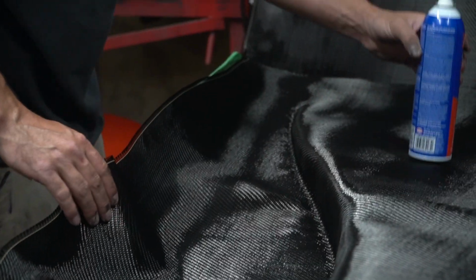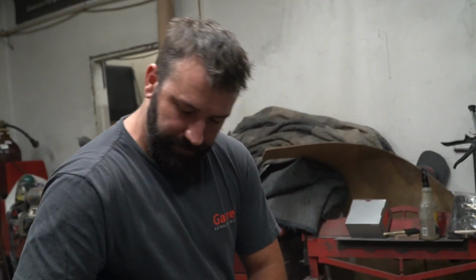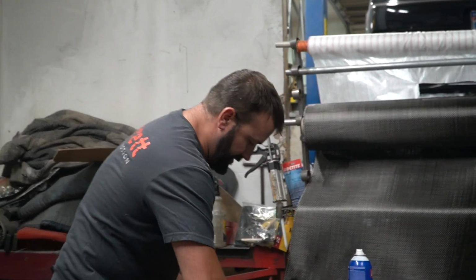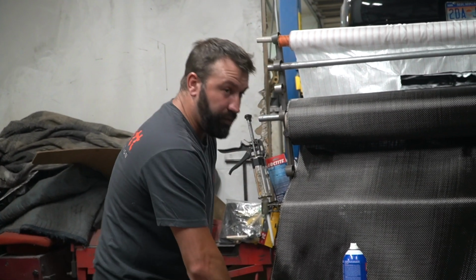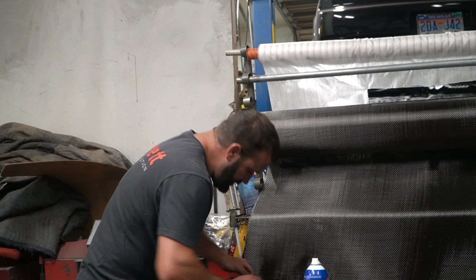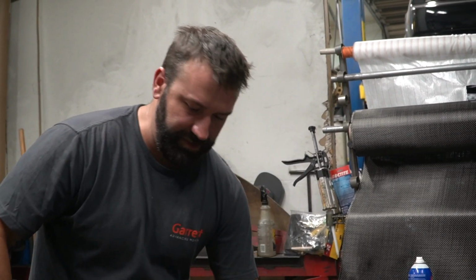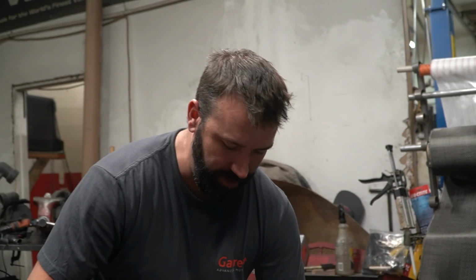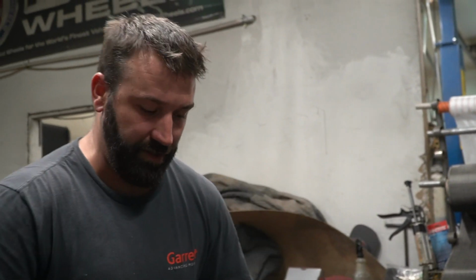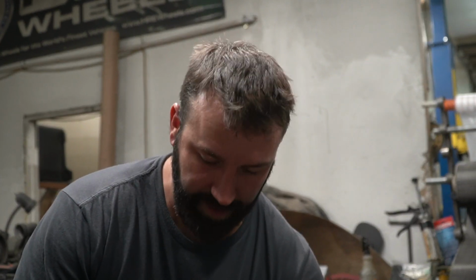And then that's kind of like a whole different kind of infusion process, isn't it? It's already infused. So pre-preg, you don't infuse. Theoretically, you can make your own pre-preg. Basically, it's just a high temp resin or epoxy that you have to get up to temperature. I think the lowest temperature ones are about 250 degrees. Which, when I cook this stuff, if I get near 200, I freak out because the epoxy boils, and then you get weird things.